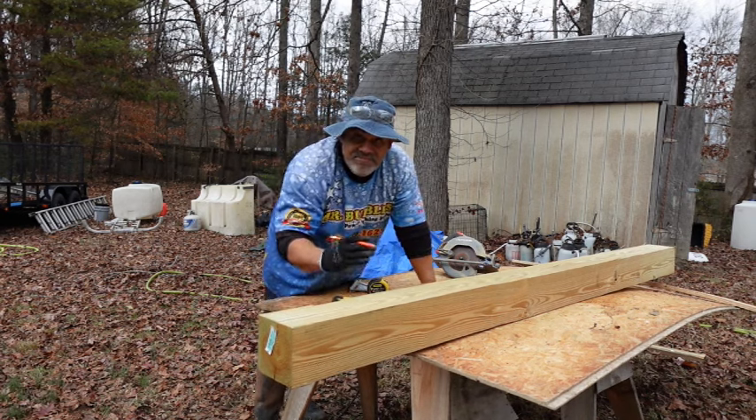There you have it — the finished product. Walking around the front, you can't even tell the base is there. It looks like those reels are floating in the air. The lag screws are three-eighths, two inches. I'm pulling on this thing and there's nothing — it's absolutely super solid. Those reels are not going anywhere. You've got four lag screws on each reel, and that's all you need. That's it for part four.